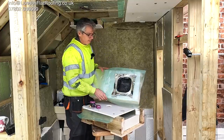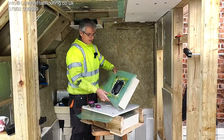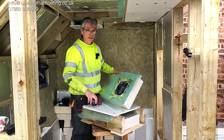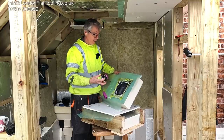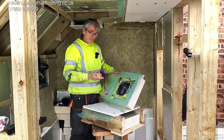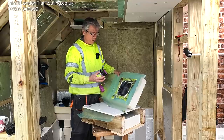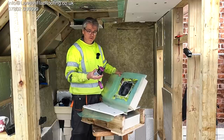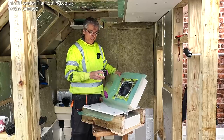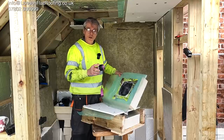There's the Thermahood and I've sealed it all the way around with the vapor barrier. It's doable, but we're expecting a builder to seal cables, get that installed and airtight, at a cost in time and money. Not only that, we've also got to find a light fitting that the manufacturers say is okay to go in there without degrading. I still think there's a long way to go. If anybody has found a light fitting that can be put into solid insulation with no air movement and the manufacturers have confirmed it - send me a link, because that is gold dust.